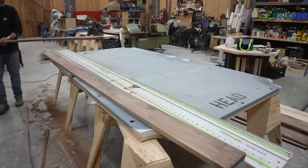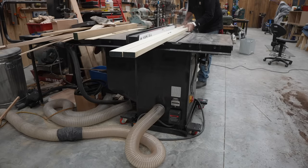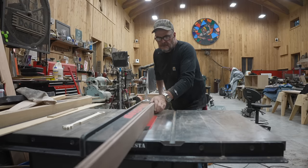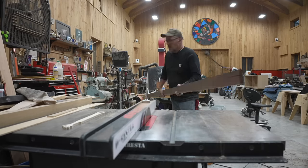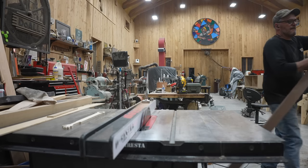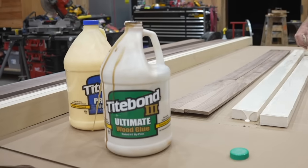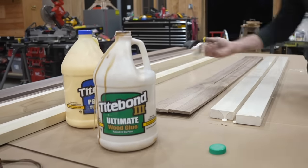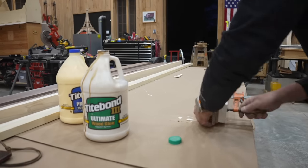Being fairly economical with the wood — the poplar isn't as expensive as the walnut. Here you see me start splitting some of it: I split the wood and glue it to the poplar, and I end up having about a quarter-inch skin in some spots and a full thickness of walnut in other spots. Of course I'm using Titebond glue to laminate everything together.